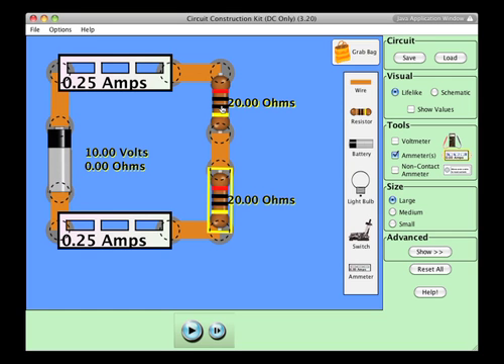This is nice because both of these resistors are shown in a logical sense as being in series. But in addition, we need to determine that they are electrically in series because the current that flows through one is exactly equal to the current that flows through the other at any one point in time.